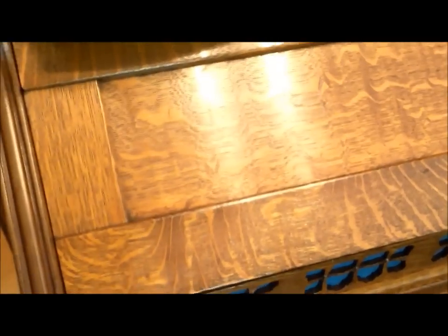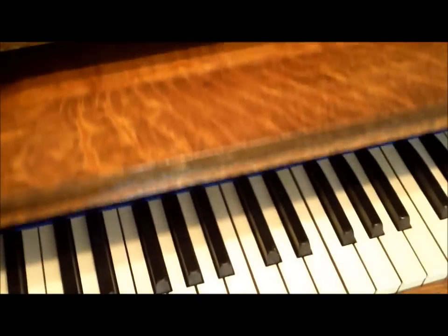In addition, there's no veneer on this. This is a three-eighths or quarter-inch thick panel of quarter-sawn oak — solid, not veneered — with the same grain going through on the other side. Quarter-sawn oak, in addition to having this beautiful characteristic wild grain with the medullary rays running through it, is the most stable cut. A quarter-inch thick panel stays as flat as the day it was sawed, with no warping or curling at all.